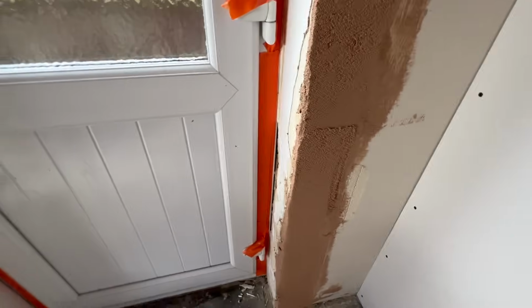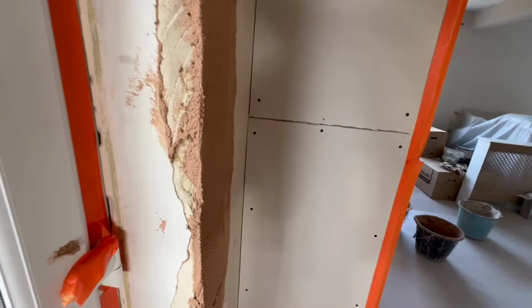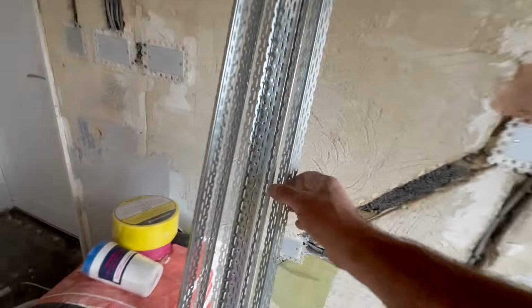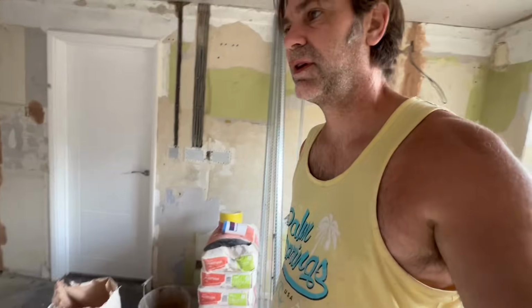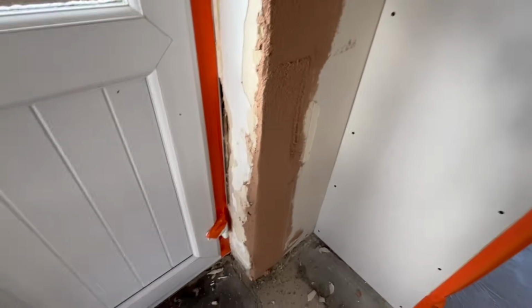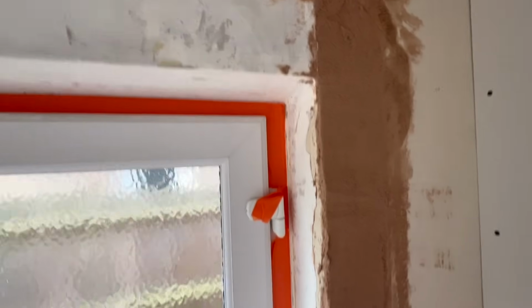Of course, that is exceptionally wet at the moment, so just leave it alone. If we need to, we can tidy it up a little bit more when it's set, but that's not far off what we want if we're going to get one of these drywall thin coat beads over that. The alternative would be to knock up some more of that plaster, get a wet bead over it, and the wet beads round off a little bit more. So, yeah, if you've got it in, form a little bit of a corner. That's probably the best thing to do, is then all the beads match up.